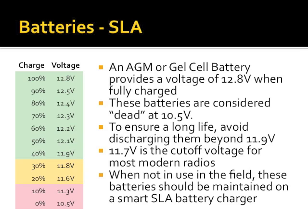Remember, our radios can in theory operate down to 11.7, but you're starting to fluctuate, and discharging this far will shorten the number of total charge and discharge cycles you'll have with a sealed lead acid battery. The red zone, you're flirting with killing the thing. There's no parking in the red zone. On average, you're going to have 200 to 500 recharge cycles for a sealed lead acid battery that you don't take below 40% depth of charge. Yes, you can discharge a battery to 10.5 or a little bit below that, but you may have literally cut its number of discharge and recharge cycles to anywhere from 5 to 50. So, that takes a toll.